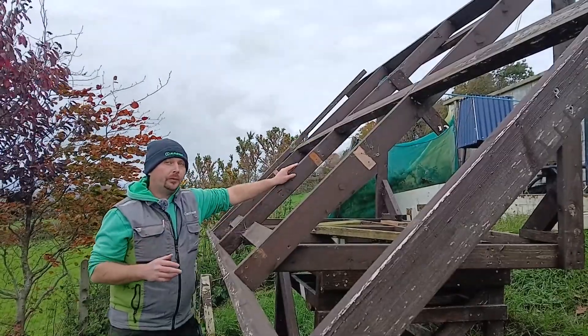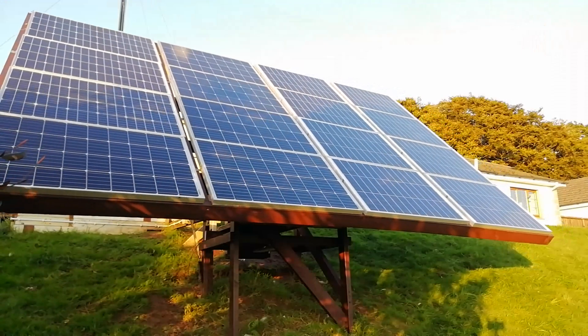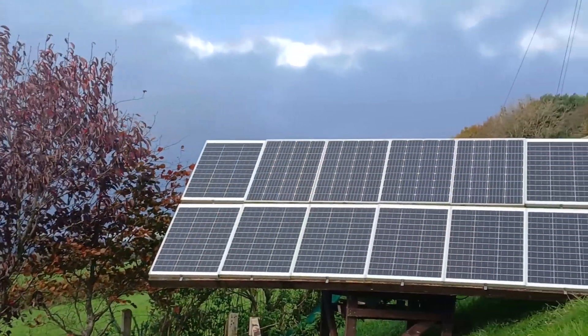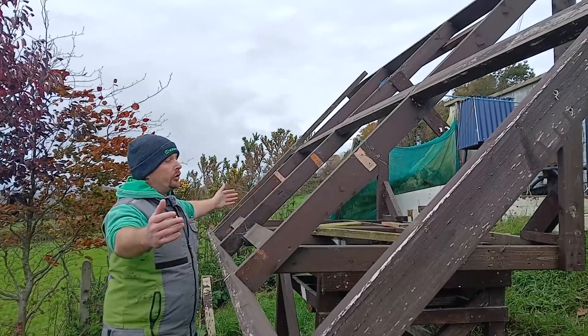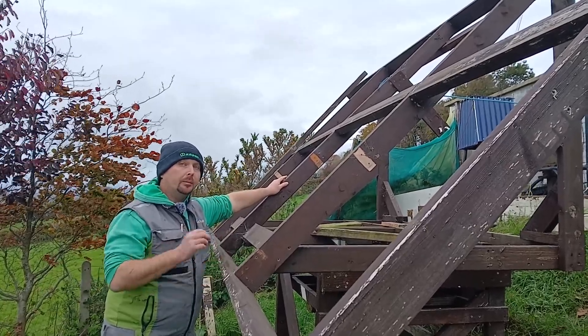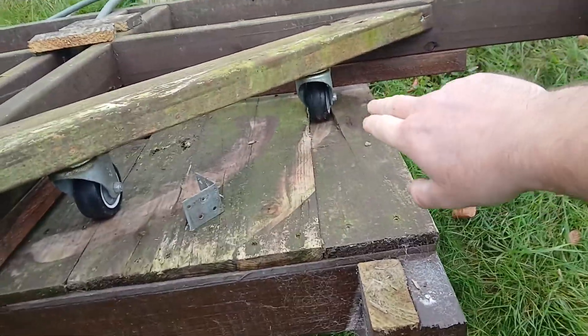If you've been following us for a while you'll have seen this in various different setups. The last one was 12 of the p-type panels which added up to 1.4 kilowatts. We're going to replace that with just four of the 300-watt n-types, so we can reduce that wind profile and keep it still somewhere around 1.2 kilowatts, but performing better in dull dark conditions.